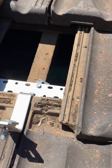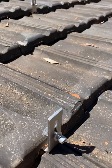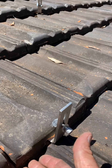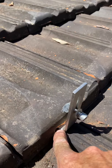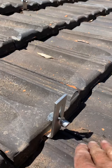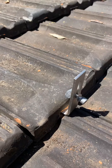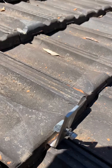Another important thing is that once the tiles are put back on, they need to sit flush again. On the lower line of tile hooks where the panels are, the wind can be strong enough to force the water back up under the tile. So we have to chip it out a little bit, like I have done there, so that when the tile's put back on it sits nice and flush again. I've been to many a job where these are sitting up pretty high and then the wind just blows the rain up and they end up with a massive leak and a massive headache for the installer because he's going to get called back.